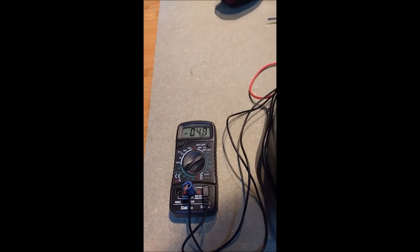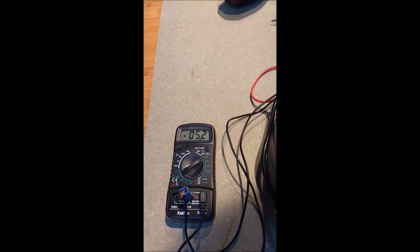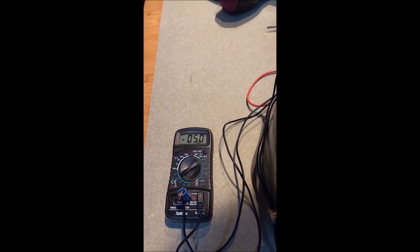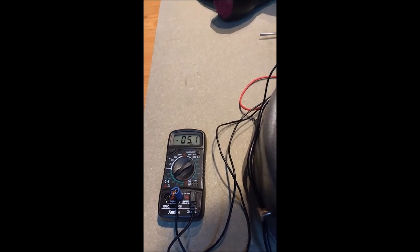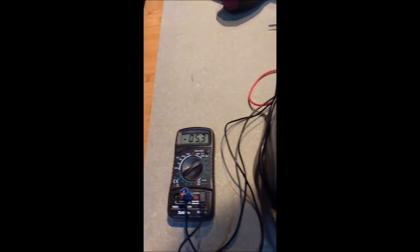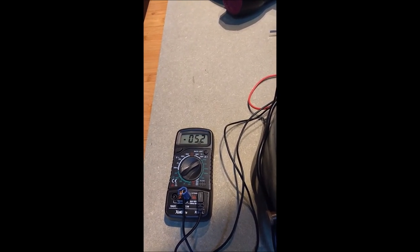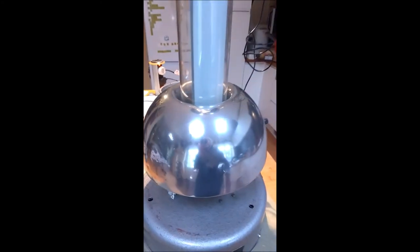The charge rate is determined by the width of the belt and how fast it's going, basically. If I turn it up, you can see it goes up — turn it down again. This one I normally run at this speed. It doesn't need to go any faster to produce a lot of charge. The voltage is determined really by whether the electricity comes off or not — so if it discharges, the voltage goes to nothing and then starts to build back up again. Well, you can see it's going wonderfully there, and it is lovely and shiny.